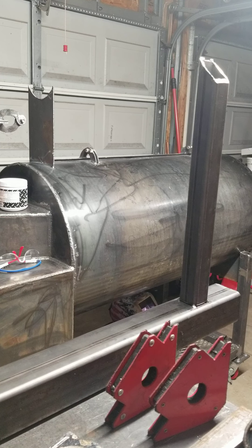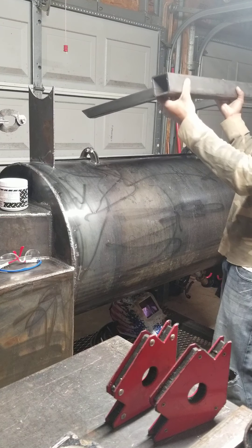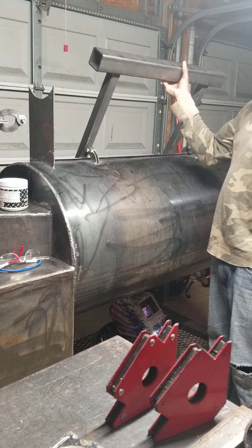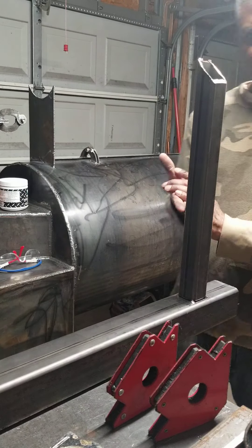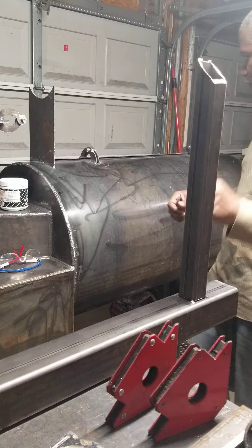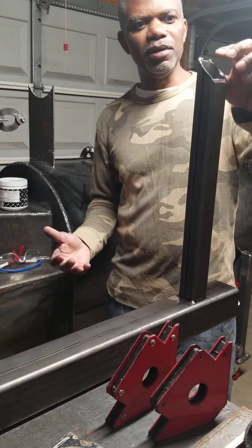I don't know what happened with my last video — I think I forgot to click start. But anyway, I'm going to add a counterbalance weight to the back of this. I've been working on basically scrap steel inside the tube, even some rebar I have laying around that I'll shove in there and test opening and closing the door to see if I can get it to the point where it's nice and balanced so I can open it up with one hand rather than lifting it with two hands.